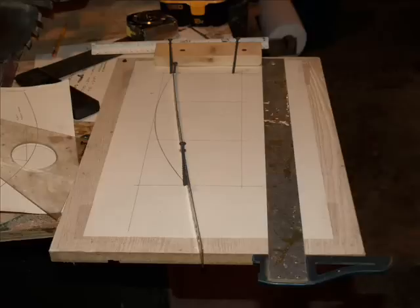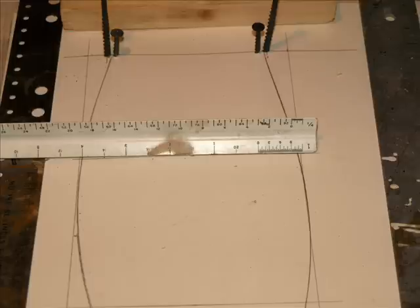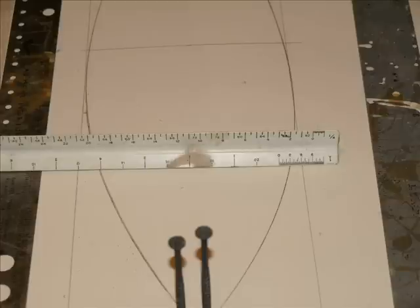And from this I could determine the dimensions for the transom, the companionway bulkhead, and the forward frame. And that forward frame is kind of important because it will both be support for the forward bulkhead of the cabin trunk, and also the support for the tabernacle of the mast. The bottom of the boat is about 5 foot. The deck beam is 6 feet. So that's how I could figure it out.